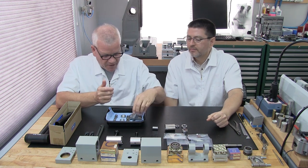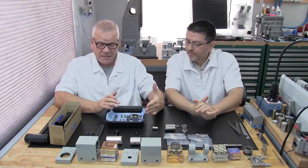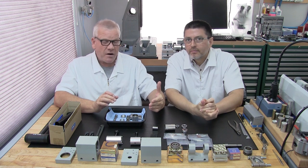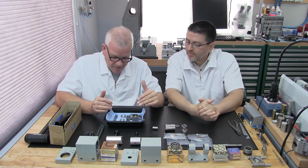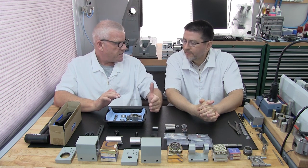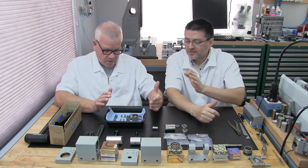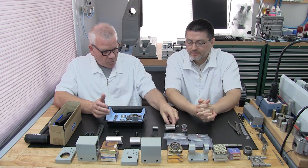What we mean by that is, we're going to clean these. I'm going to inspect these, and some of it may require dimensional inspection. That means we check it as we clean it and get into it. And we're going to sand and file whatever is necessary. Stone, I do that. Make sure there are no burrs or anything. Sometimes when they're really old, we just have no choice.